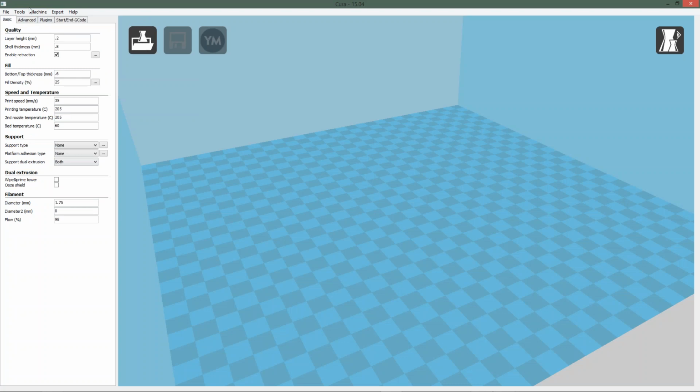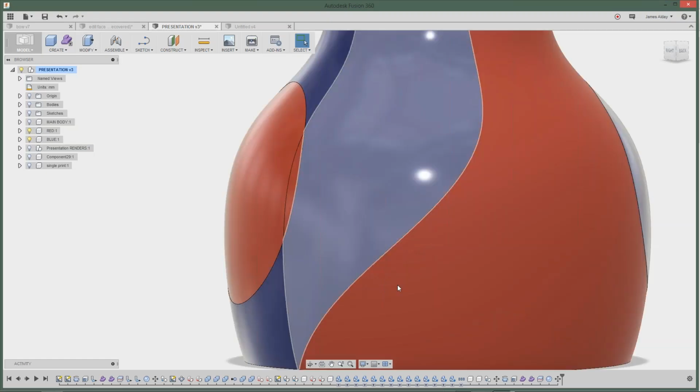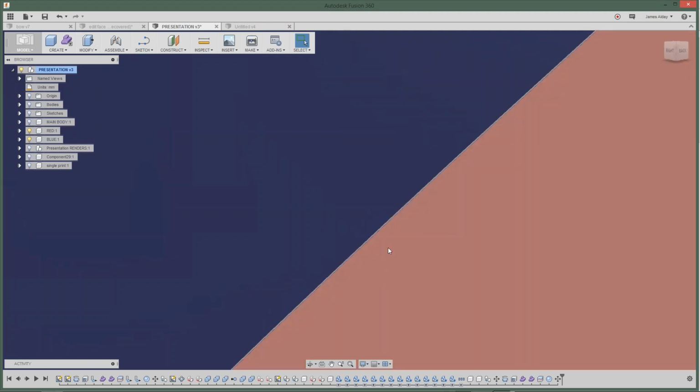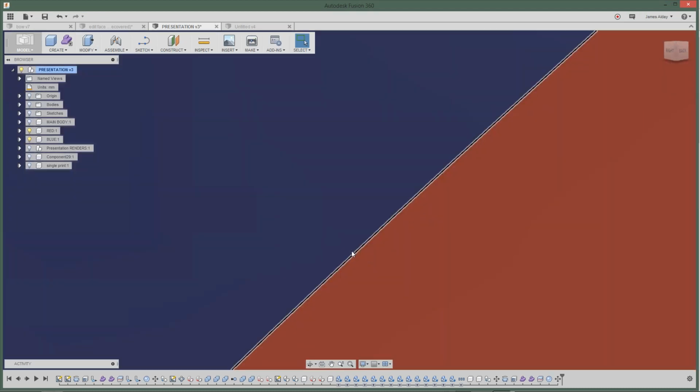But yeah, as long as you're properly calibrated, it's just like putting one layer on top of the other. So as long as all your layers stick together properly, then the two models should stick together the same. Because there's no tolerance, there's no space in here. As your machine's running through, it stops, of course, and switches heads and comes back and just continues right where it left off. So as long as you're calibrated and the settings are right, there shouldn't be a gap here.